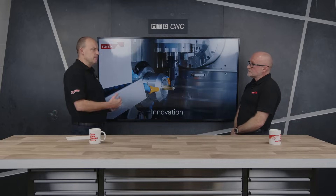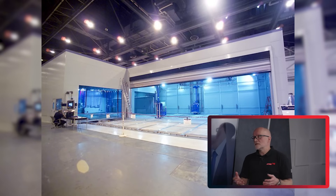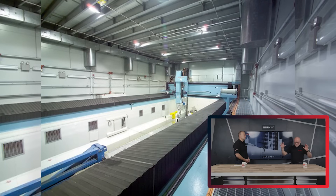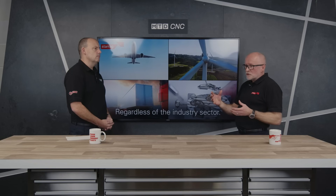I'm guessing there's more focus on speed and precision than power in this. Well it's more about accuracy. Of course you want to produce these components as quickly as possible, but if you take a panel off an aircraft you want to be able to put a panel back on with a perfect fit. So what we're able to do is volumetrically map the working envelope of the machine tool and produce any geometrical compensation, so that when we cut a five-axis profile we're within 30 to 40 microns true five-axis volumetric — so every part is exactly the same.